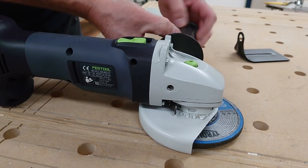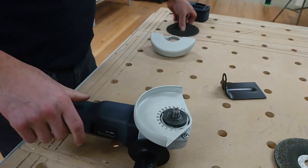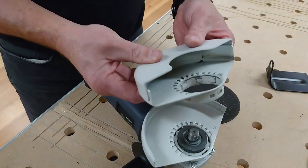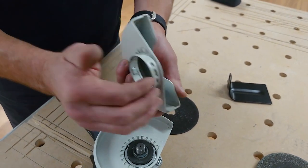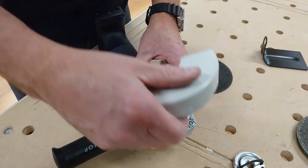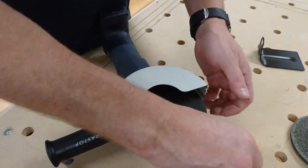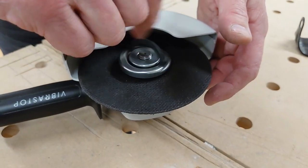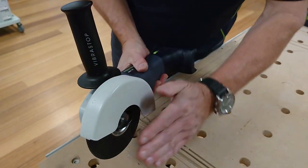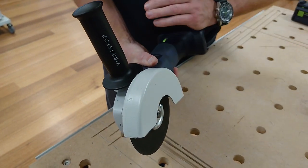When using a cutting disc, what can happen is that the swarf gets thrown directly out at the user. We've also got this protection cover that encloses the blade a lot more and stops that swarf coming out. We can bring this hood all the way to the front, drop it on, and position the guard so that when cutting, it keeps most of the swarf inside and drops it out rather than hitting the user.